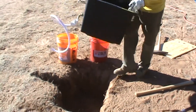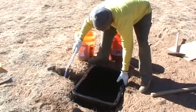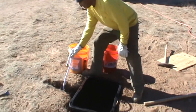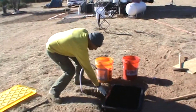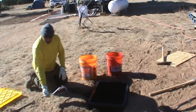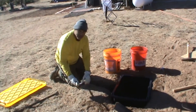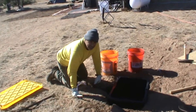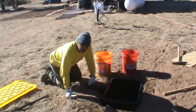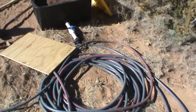After that, what I got is this here — it'll go in there just like this. This hose will come out, and this one will be dug in about 2 more inches until I get a good slope. This will come out here with enough room so I can turn it on and off if I need to. This will go into a pump, and the pump will be in a box right here, which I have attached to a DC pump. Just clips to a battery, and the battery will be kept charged by a solar panel, and then we can cut the pump on whenever we want.